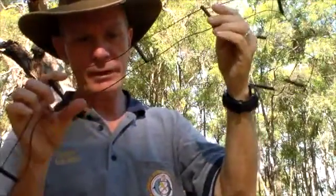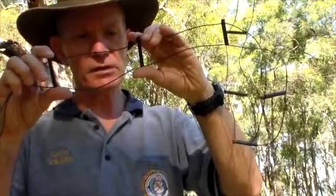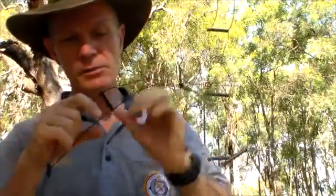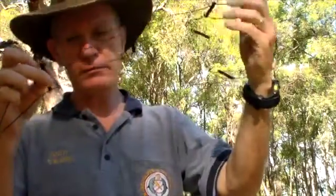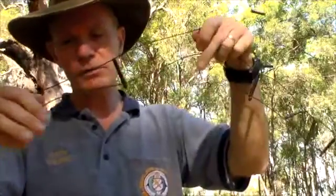Okay, well, the antenna I'm using, the feed line is just simply the good old open wire feed line. Hopefully you can see that on the camera there, but it's homemade, made out of a light wire, mil-spec stuff called Don 10, and the spacers are actually just watering system risers from that hardware shop, the big green shed, and again using some zip ties to secure it. Basically every 150 millimetres I have put in the spacers, and there she goes. That's what works for my open wire feeder for the doublet.